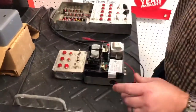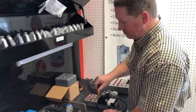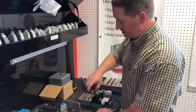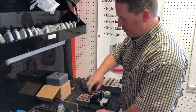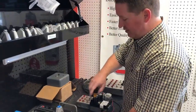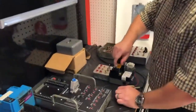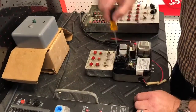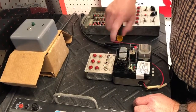Shutting her down. And last but not least, in the Honeywell world, you must be highly skilled in the ancient Honeywell arts of cardboard origami. So bear with me as I run out the 82 screws that are present in the Honeywell RA 890. I think the reason that Honeywell got rid of the RA 890 and the 4795s was because of carpal tunnel lawsuits from people having to run all these screws out of these sub bases.